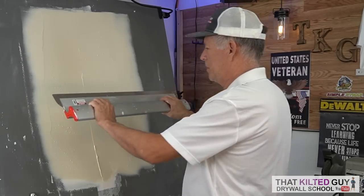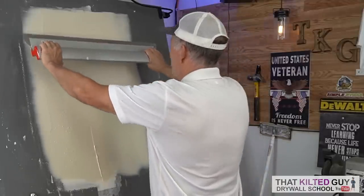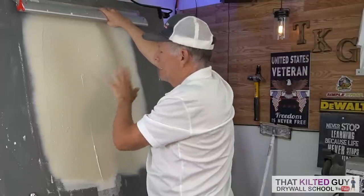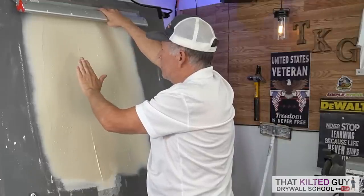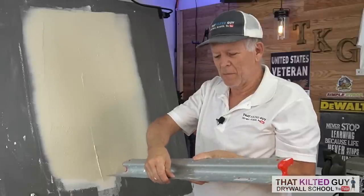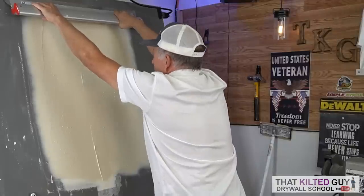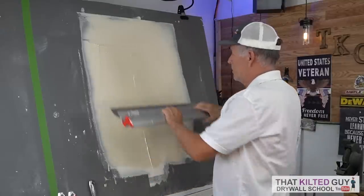When you do this, hold the blade wide - not too narrow, or you lose control. Try to apply even pressure. The more you stand the blade up, the more mud you take off; the more you lay it down, the less you take off but the more likely you are to leave an edge. Standing it up also flattens more because the blade doesn't flex as much. I'm leaning it at roughly a 45-degree angle with firm pressure because it's a wide blade.